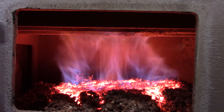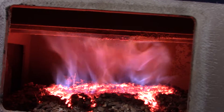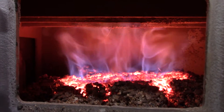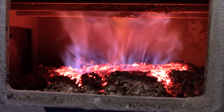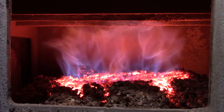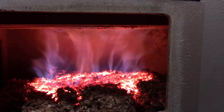I'm going to try to compensate for that a little bit by turning the air up. Currently the air is set at 4. Van Wert wants you to run buckwheat coal — of course this is rice coal — starting out at 2 or 3 and slowly turning the air up. Most people say they end up with the air at about 3.